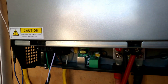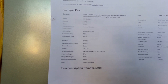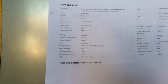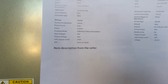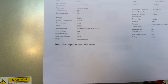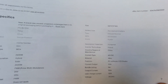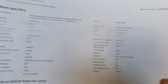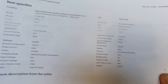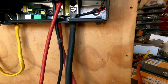Let me look at the spec sheet and tell you a little more about this. It's a PS3K, 110-volt, silver, good for indoor and outdoor use. Current rating 50 amps, connector type MC4, wattage 2400. It's a hybrid solar 2400-watt pulse-width-modulation unit. Input voltage is 24 volts, output voltage is 110/120 volts PWM. It works with a 24-volt lead-acid battery — it's a charger-inverter, all in one, dustproof, AC/DC, and doesn't require any software. Output current 50 amps, solar charge current 50 amps, voltage DC 24 volts.